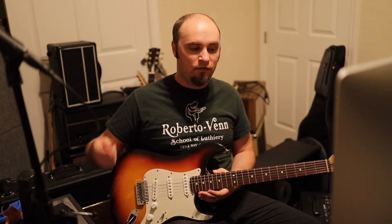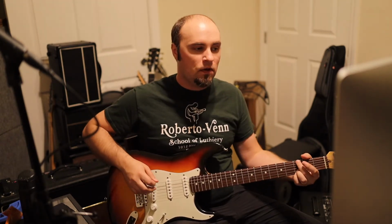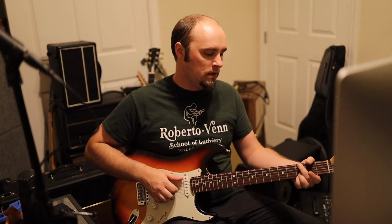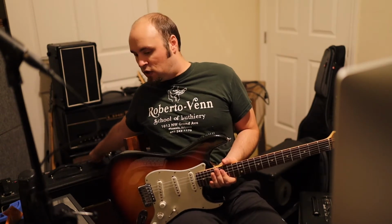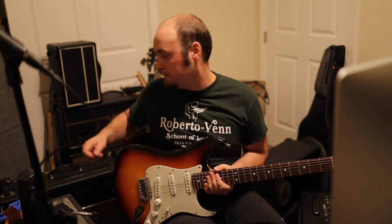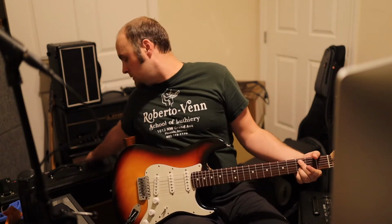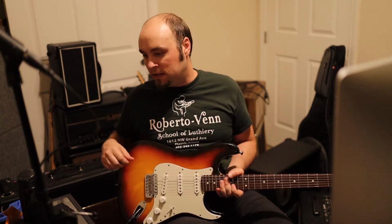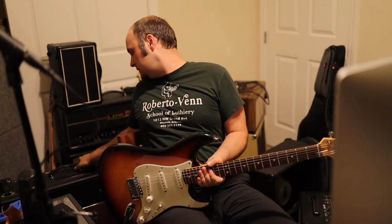But the other big difference between the Fender amps and this one is the removal of the negative feedback circuit. So that thing that Fender was trying to get rid of, Vox was trying to get more of. The guitar players in the 60s wanted more gain. They wanted that sound. As you turned up the amp, they wanted it to distort more and more, right? The problem with that is if you go anywhere and you try and play, it's super loud. So Vox ended up adding the top boost circuit.